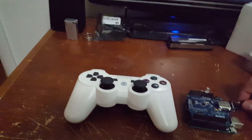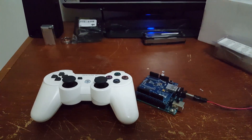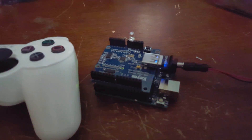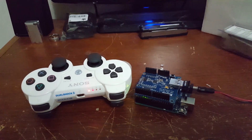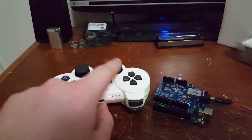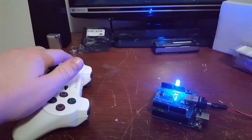Let's plug in the Arduino here. It's never a good idea to run an Arduino off a 9-volt battery long term, but I'll just do it for now. The Bluetooth adapter is on and it makes a solid blue when it's not connected. I'll turn this around so you can watch it connect — press the PlayStation button, press the little flashing thing. The Bluetooth adapter starts flashing to let you know communication is being established — and bam! Now it's communicating. The PlayStation goes solid and that flashes, just to let you know you have communication. Now the big moment — push the left button. Boop! Boop! Boop! Pretty cool, huh? Complete wireless control of the LED, and it's practically instantaneous.